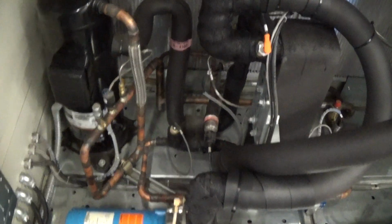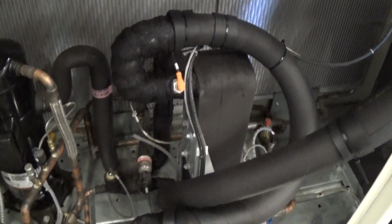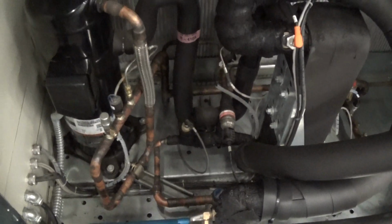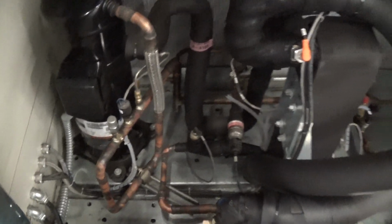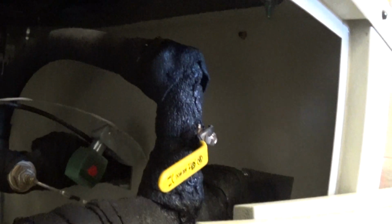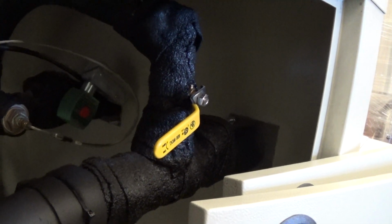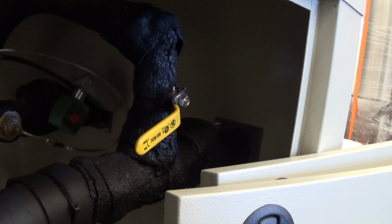This chiller has electronic everything. We have two different sensors for temperature location. We have transducers for pressure. We have the motorized hot gas that I mentioned, and motorized expansion valves, all controllable and adjustable through the controller. Again, very impressive. We have a little manual bypass in here. We'll leave that cracked open. You probably don't have to put a bypass valve at the end of your supply line in your brewery, because we have this cracked open.